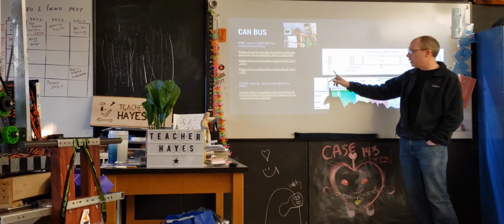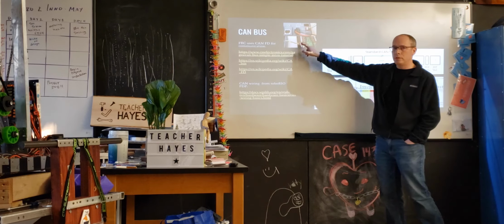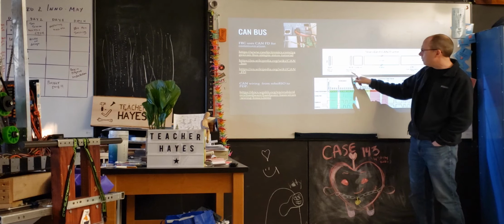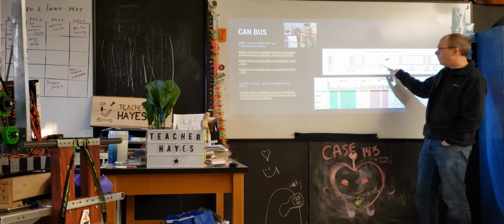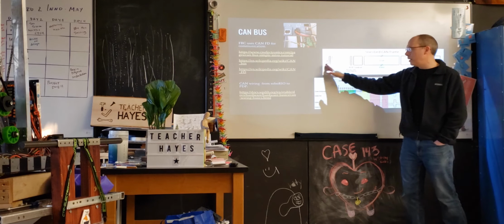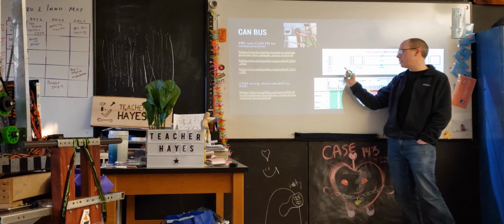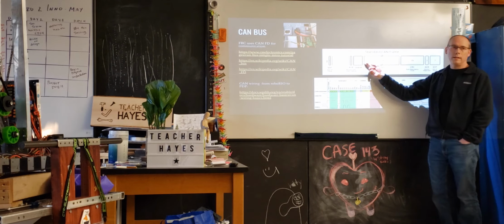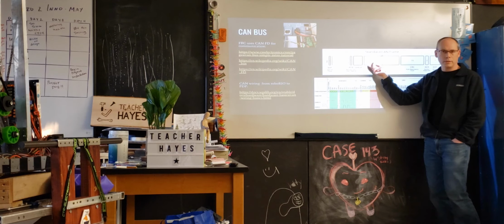You're going to have a one that's going to be your starter frame. There's an ID which might be associated, I think that's actually the CAN device itself that you're on. There's RTR, there is then your data payload. So this is common. Every time one of your things wants to send some information, it starts with this: hey, I'm device number one, I'm starting a frame. Okay, I'm going to tell you, this is the information I'm telling you. I have a broken something or other.